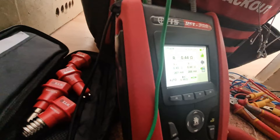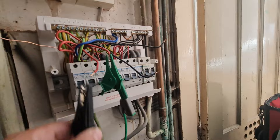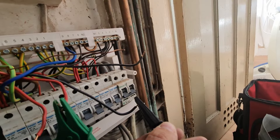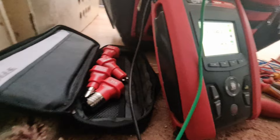We've got 0.44 ohms on the line legs. Taking it straight over onto the neutral - making sure you get a good connection in the crocodile clips so it's nice and bitey for a good connection. The neutral reads 0.43 ohms - should come out at a similar value, and it does.